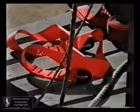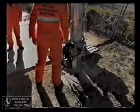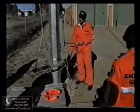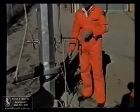It was a lot messier than that. That's pretty neat. But the question you've got to ask is, where's your single point of failure here, and is this designed to do that sort of thing? It's designed to take a single person's weight, but it's the rating of the buckle we've got to start questioning. It's also the use of the thing. In roping, you use what's designed for that use, because it probably will fail if it's used for something different. My suggestion is that it will hold for a period of time, and then it has a possibility of failing, because it's not designed for that sort of thing.